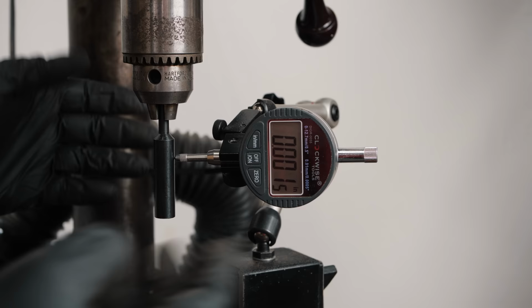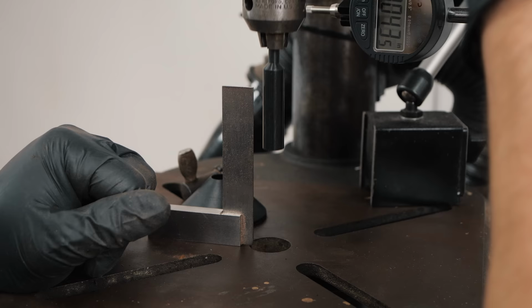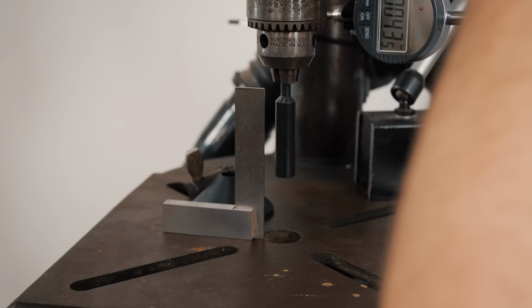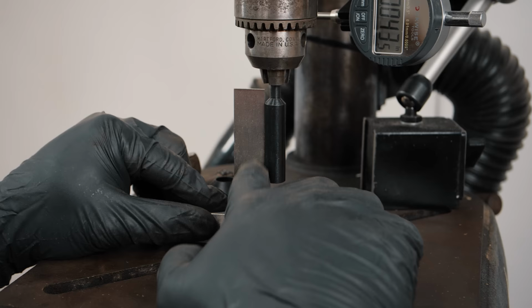So now let's go ahead and check this for square. We're gonna use the same smooth shaft as we did before, and then we should be just about done. Now when you're checking for square, you wanna bring your quill down, probably close to fully extended, so you get the most amount out of it that you can. Then you're gonna take a square. These engineer squares are great, I'll also link those. I'll link everything I used in this video down in the description, but you're just gonna pull it up next to it, and you can see there's no light, top or bottom, that's good to go.